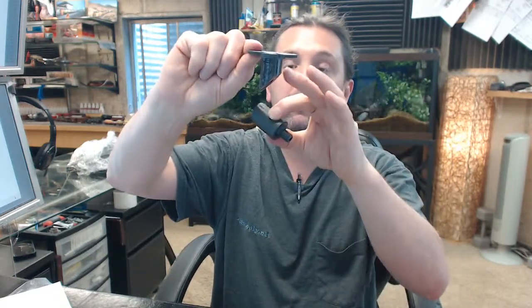There's a star preparation down here and a square preparation on the bottom of that, but we'll go over that more in a moment. So you've got your cylinder and cam. The cam is inside of there. It's all but impossible to see, but it mates up to the mitered aspect to this collar. Okay, and then of course the nut that holds it on to the bottom bracket. And you know you've got the bottom bracket because it's got the star preparation in it.